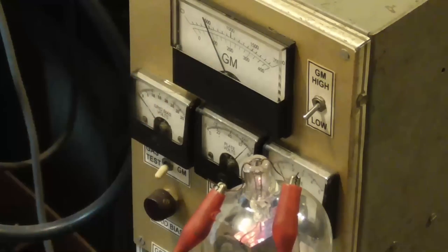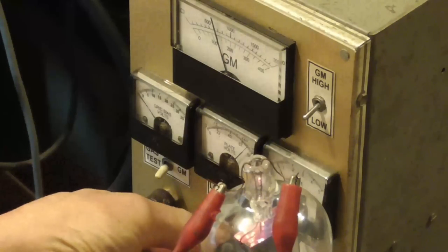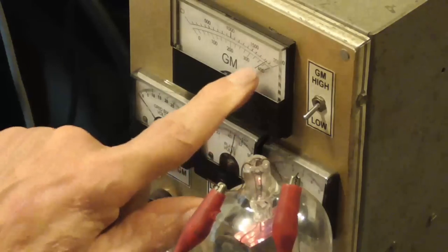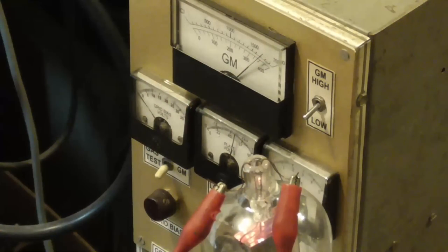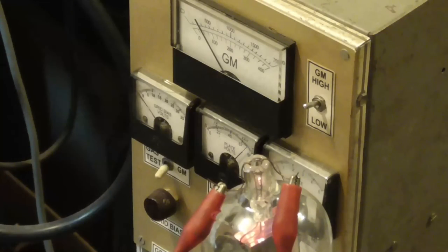The transconductance of about 100 right now, which is very bad. Getting about 10 milliamps of plate current with 90 volts. When we cut it down into its good operating region, we get a transconductance of up to 400. But what it means is that the filament is saturated. We've got to let the pressure get out of there to where the filament can be heated up. We're still at 10⁻⁵ torr. It's going to take it a while to pump down. If we let the blue glow go, it'll destroy the filament. So we've got to keep it down below the blue glow.